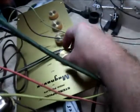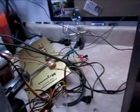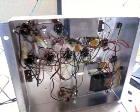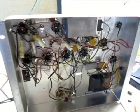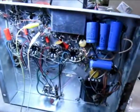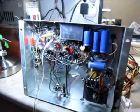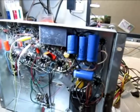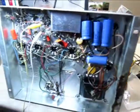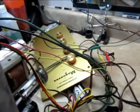I first thought it was in this switch, but that turned out to be okay because I have a spare amp and this one was working properly using the same control panel. So I isolated it to this amp here. I originally went over this in 2008 and replaced bad capacitors in it, and then it developed the problem where the speaker selector wasn't working properly.